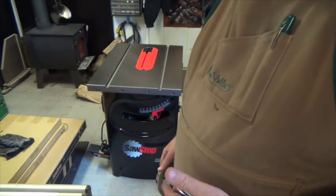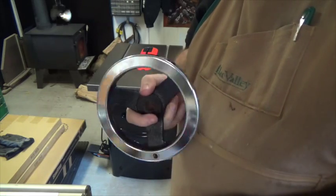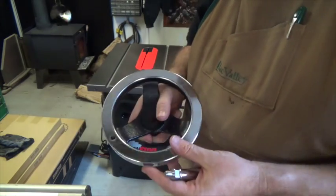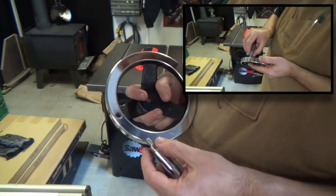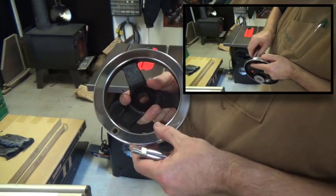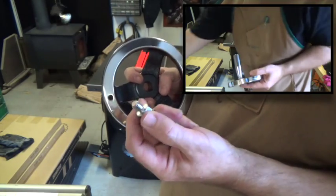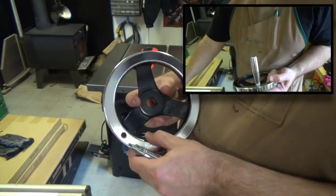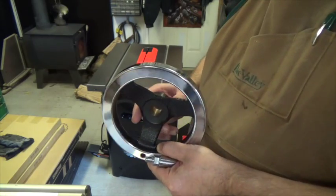We've got all the oil cleaned off the top of the main body of the saw. The next thing is installing these hand wheels — this one here will be for the elevation, and then of course there's another one for the bevel. These are pretty solid compared to my old Rigid saw; all metal construction. I'm going to screw the handle in and put a little bit of Loctite on here, then install it on the shaft for the blade elevation.